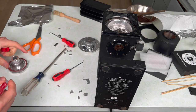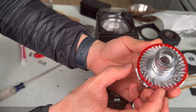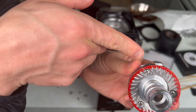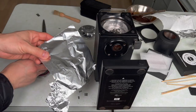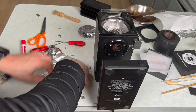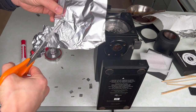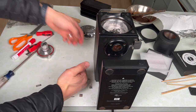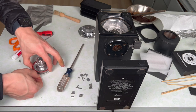So I'm going to try another wipe test. Now you can see our baseline — this is the highest point. What we want to do is actually raise up this point over here. I'm going to fold this foil over two more times and put a new shim underneath at the two o'clock position. I'll fold this piece of foil over one more time so you can see what I'm doing, then cut a new shim and put it right here — just outside of the shim graveyard, the evidence of my wasted life. Unscrew these guys a little bit, pull out this shim, and put this new shim in.